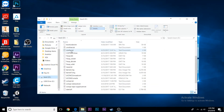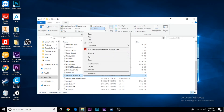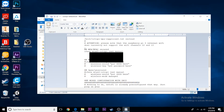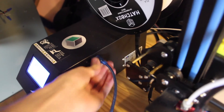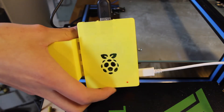Once finished, open up the boot drive — your micro SD card — which now has all the OctoPi folders and files. Edit the Wi-Fi connection settings by opening the file octopi-network.txt in the root of the SD card. Don't open it with regular Notepad — use Notepad++ or WordPad, since some editors mess up the file format. Scroll down to the WPA/WPA2 section, uncomment the two lines for password and username by removing the hashtag, and enter your Wi-Fi name and password. Save the file.